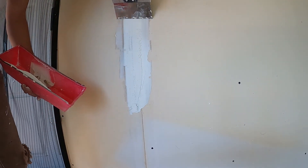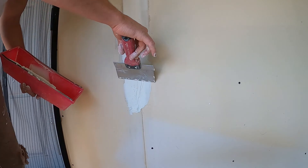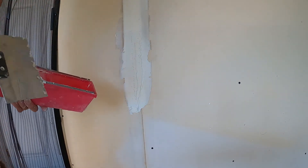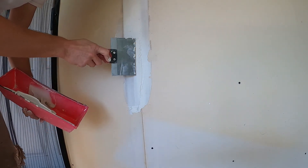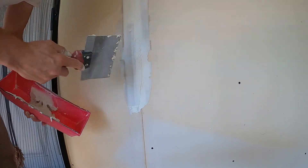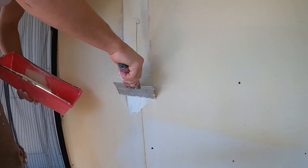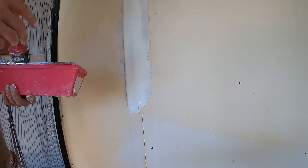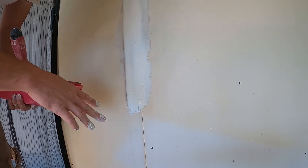We've got a little bit of an edge showing there — that's actually frayed up, so I'm going to go ahead and scrape it down, reapply mud over it, and give it another pass. And that's exactly what we want — everything nice and smooth. This is where the sanding blocks come in handy. We're going to set a fan on this and let it dry, or just come back the next day without the fan — whatever it takes.